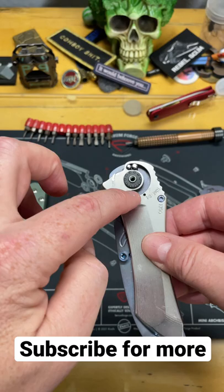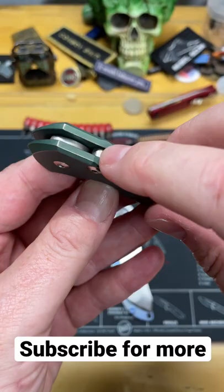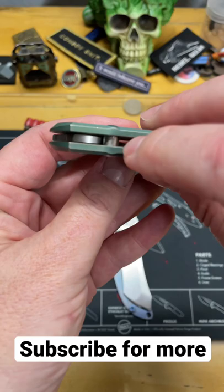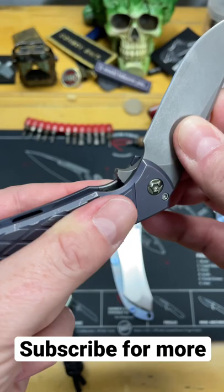In a standard knife — and as much as I love this knife — this one controls both the open and the closed position. If I change the size of this, I'm going to change both positions, and then I would have to remove material on the blade, like we had to on this one, to control the closed position so that the knife will actually go into the lock position. And as you can see, that lifts the blade up and changes the actual closed position.